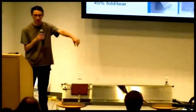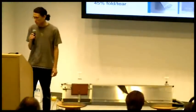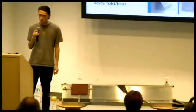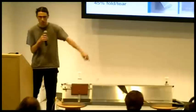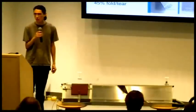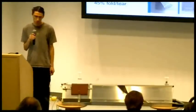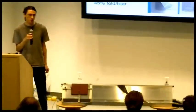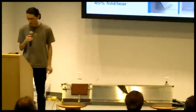That's a number that could also be improved by changing some of the dimensions, basically doing a bit more experimentation with how the thing is shaped. And then for thin pages or thick pages, one major factor is the power of the vacuum. It's best if you can adjust that, so for very thin pages, you don't want to pull too hard on them. But again, there's a limit on what you can do for that. So this works on most books we've come across, but it won't work on dictionary thin pages or really stiff kind of cover page material.